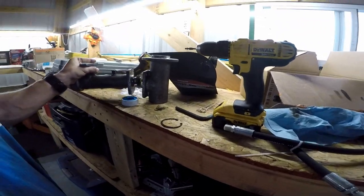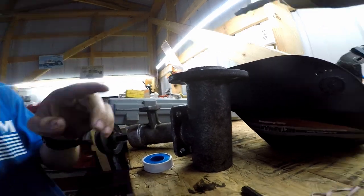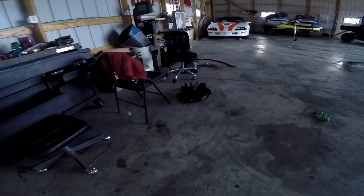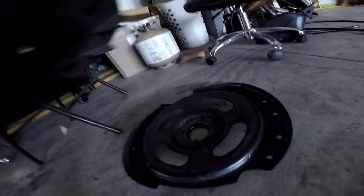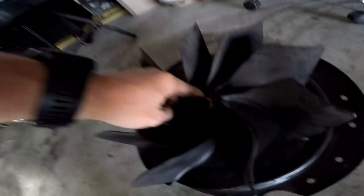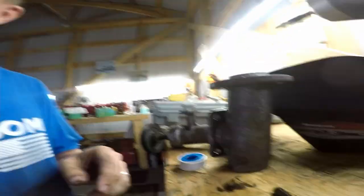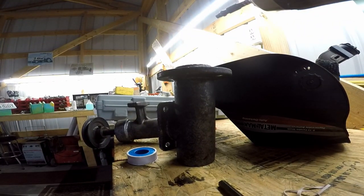I've already taken this apart. The fan wheel is right here — this is exactly how it's going to be. It'll be attached via those four bolt holes in the center to that right angle drive, and then this has threads in here, here, and here. But mine were stripped and useless.